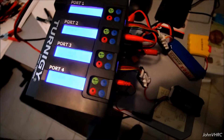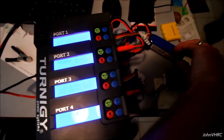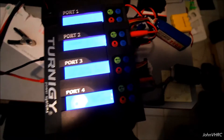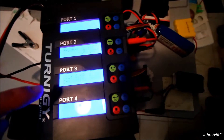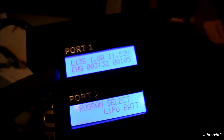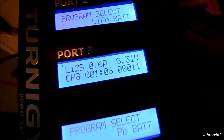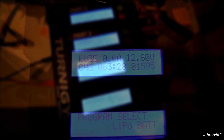Okay, here we go. We've got a 2S — I'm in the light here, but I've got my FatShark goggle battery charging. And we have a 3S 2200 LiPo there. So this is a 2S and a 3S. Here you can see the 2S settings I've chosen for this one, and then standard 3S settings for the other one. I don't overcharge mine too fast — I charge them fairly slow, pretty conservative on my numbers. So there's two ports going at the same time. We'll come back once it's charged and see what it's at.